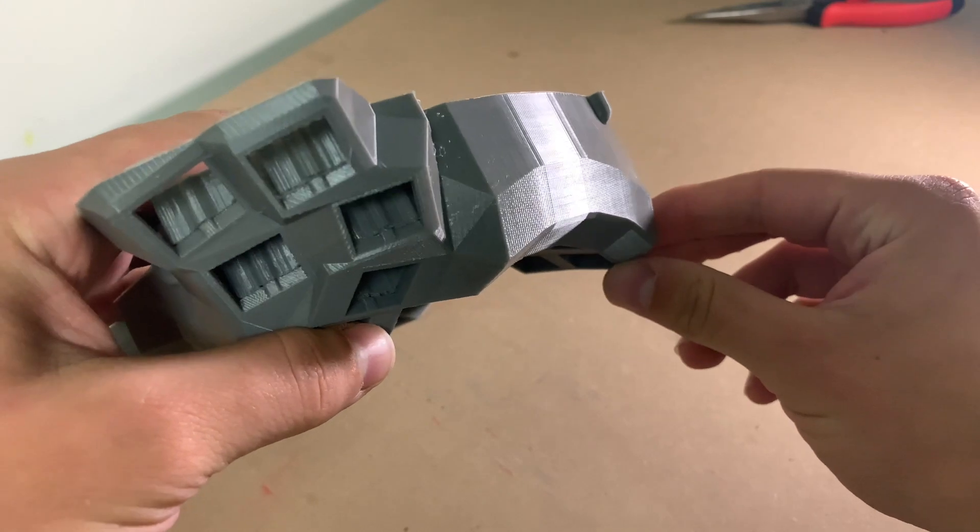I've had to watch out because I have a metal base — I have to make sure these wires aren't too long and don't short out on the bottom. I've finished wiring up both sides and worked out that on this connector, once it goes through the cable, the contacts don't come out the same — the black and yellow swap, and the orange and gray-green swap as well. So on this side I've got power going to orange, ground to black, and data on the gray-green. On the other side power needs to be on gray-green, data on orange, and ground on yellow.